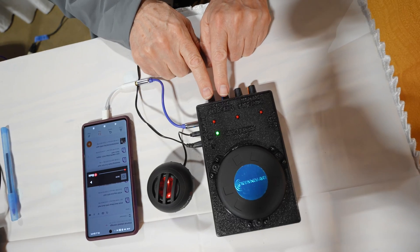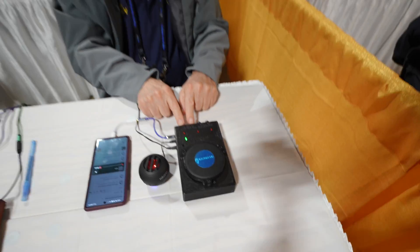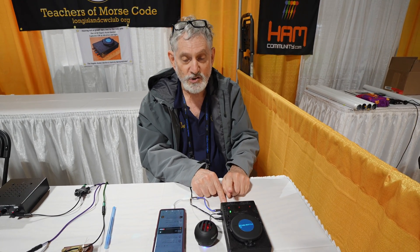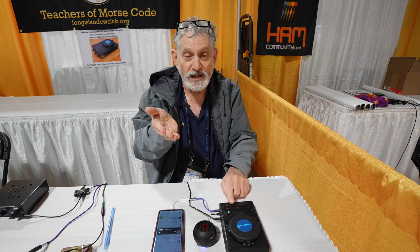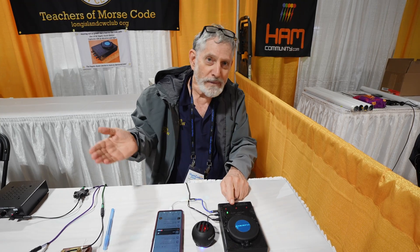There's a front-end integrated circuit which acts as a very narrow-band audio filter. It finds the tone that we've selected — one of these controls is the tone it's listening for, and then there's the sensitivity: how much gain it needs to bring it to a level where it can detect and tune to the frequency. I didn't put any software in there. Elecraft, Flex — they're all better at that than I've ever done, so why duplicate them?